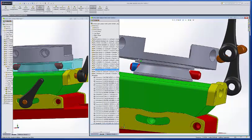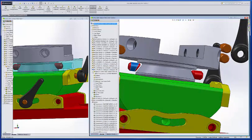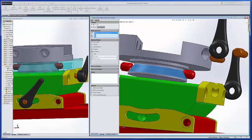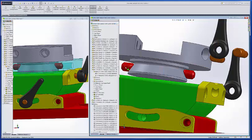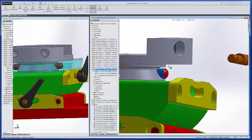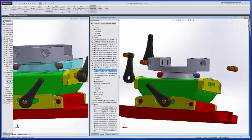You just rotate those around until they lock in — but this one's out of place now and it looks like we lost our tangency. I said that undo kind of made me nervous. Looking at that, I've just got the concentricity, so I'm going to have to get that one back. We'll go to mate, pick this face — the circle — and accept it. Close that. Now I'll rotate this around until I get that locked in. It takes a little bit of doing. There — it finally locked in. Let's make sure this one stayed locked — and it did. So both of these are locked on tangency now.